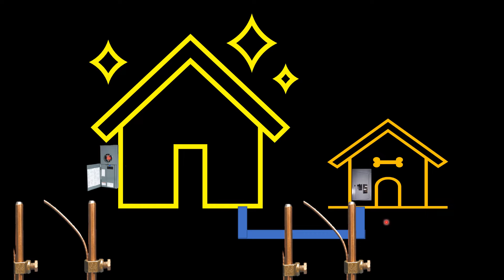The same thing is happening over here at this detached building. We've run our four wires over and separated our grounds and neutrals. But the question is: are we at any less danger of static electricity or lightning strikes? And the answer is no, we're not. So we definitely need to establish a grounding electrode system at this separate structure to perform the same functions.